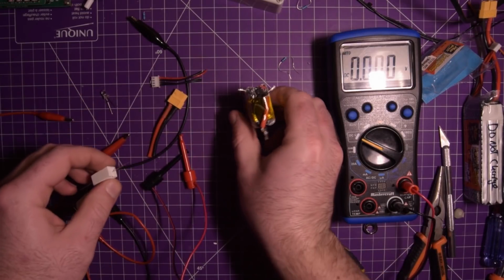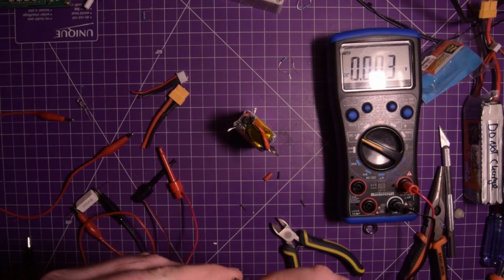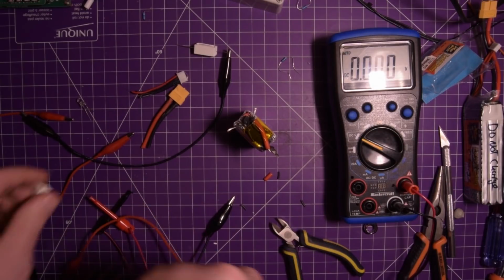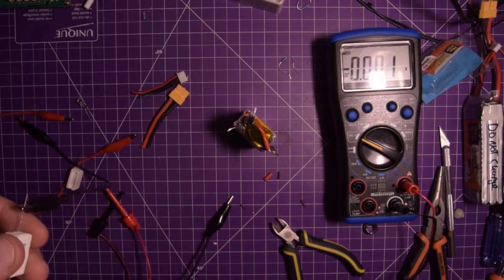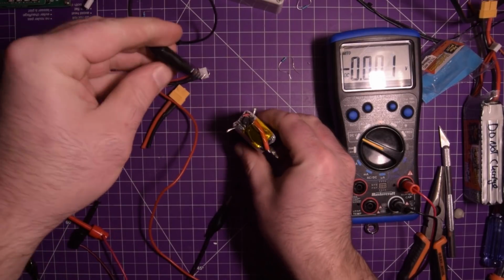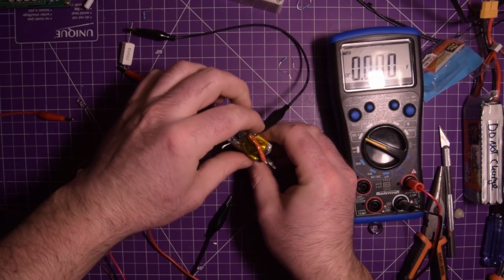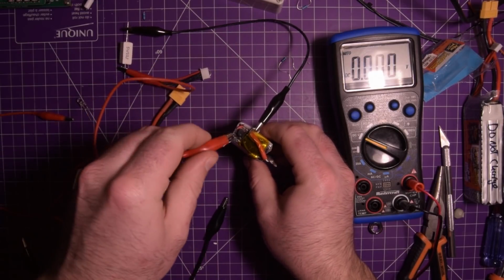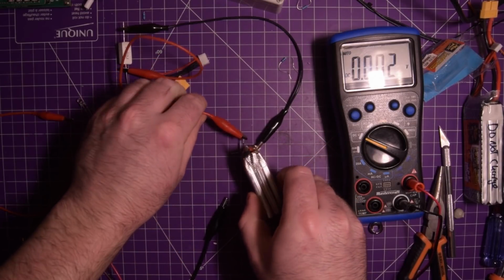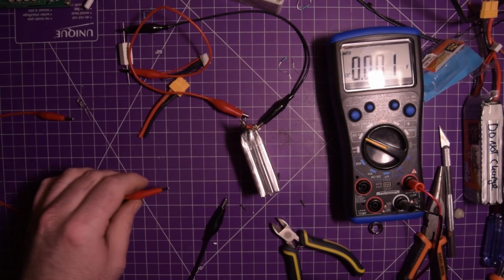So here's what we're going to do. We're going to discharge these cells. We're going to have a choice. So I'm going to put my resistors onto the individual cells to try to drop them down. I guess I should have done that. So here comes one. Between here, I'm going to fold that over so it doesn't short. And this guy. So that'll be going down.